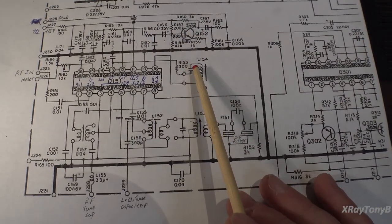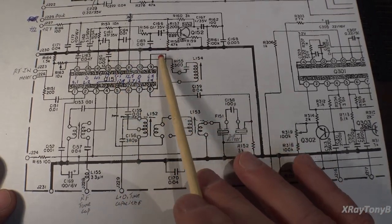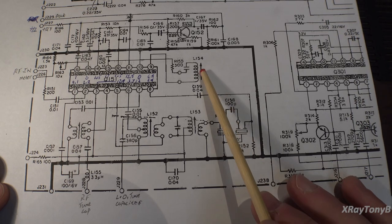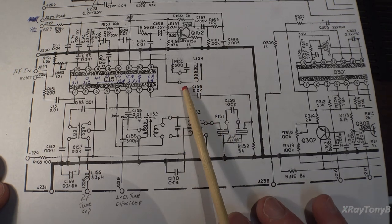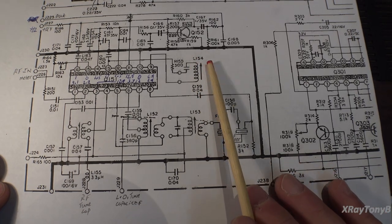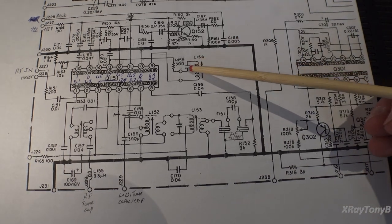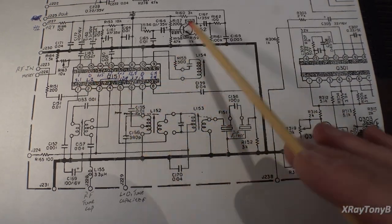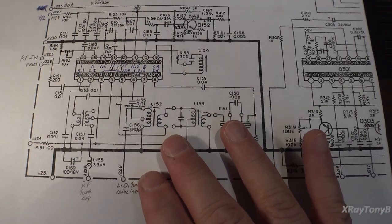This took quite a while to figure out because this was one of the first things I pulled out of the circuit — I could tell the oscillator was stopping. I took it out and swept it with my spectrum analyzer, and it even tuned in. It was working. Then you'd put it in circuit — boom — it would die again. I even tried checking this with the capacitor checker with the leakage — I put voltage across it. It didn't matter. Then finally it failed. Just a little word of warning: if you're working on one of these, this capacitor can short and can cause other problems in there. But all's good now. Just wanted to share that with you.